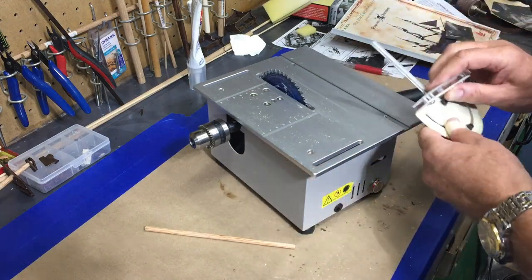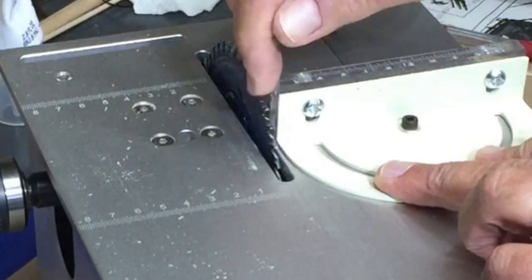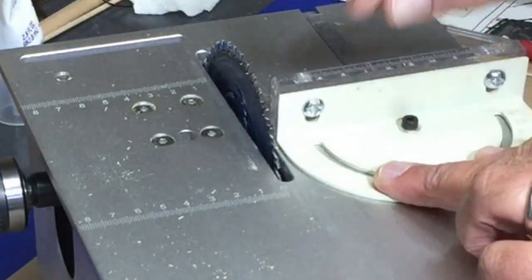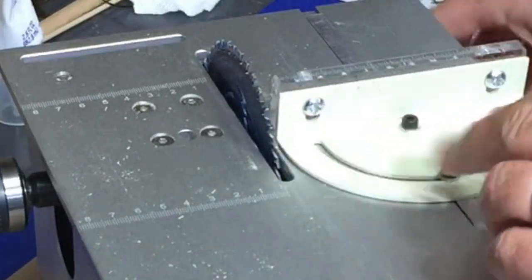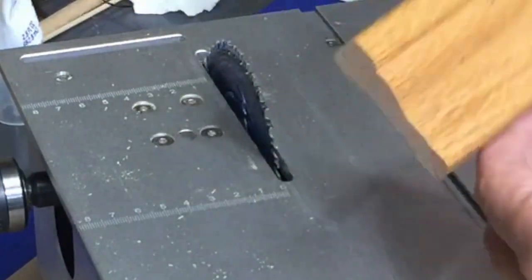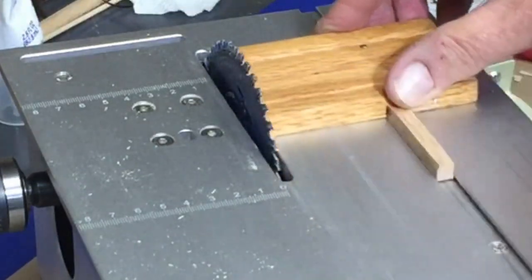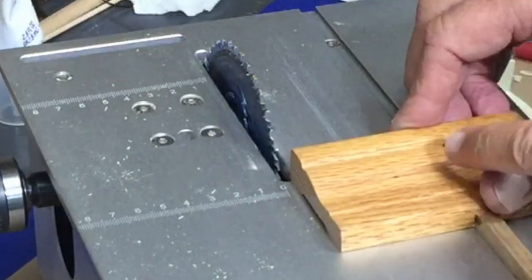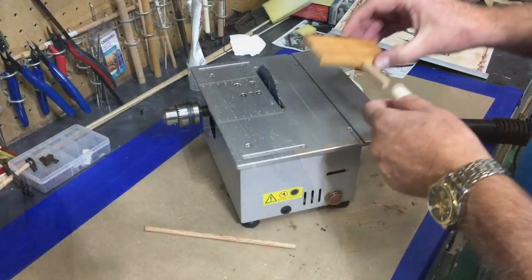The other thing is this slide — it leaves a little bit of a gap between the blade and the fence. Because I sometimes try to shave wood down very thin, I was having a problem with that, so I just took a couple pieces of scrap and made this. You can see it goes right along the edge of the blade, so I can get thinner cuts and not worry about the wood getting sucked down into the saw itself.